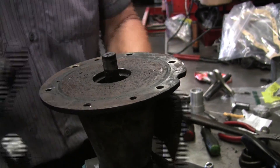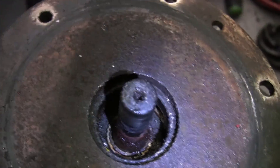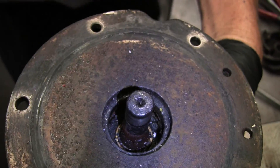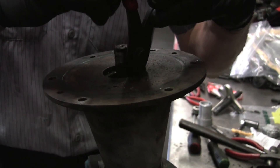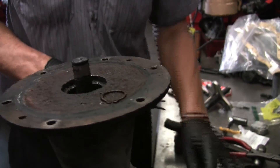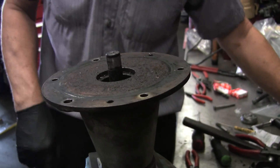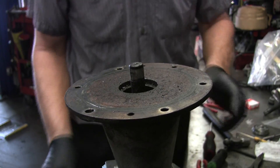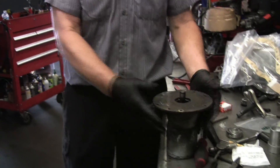Do you resurface that face? I will put it up to the wire wheel. Now we get down to the snap ring in there that's holding it all together. You see the two little ears with the holes in them? That's what the snap ring is — that's what's holding the shaft inside the two bearings. So now we have to get that shaft out. The natural idea is to just tap it, but you're going to mushroom this. So we have to be real careful. I've mushroomed so many of these. So I take a piece of pipe, use the press, and just push it out.